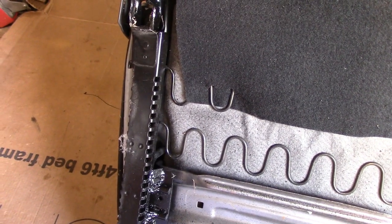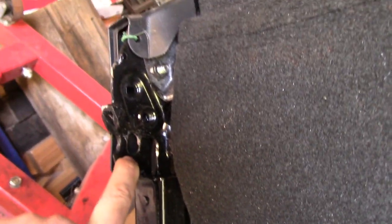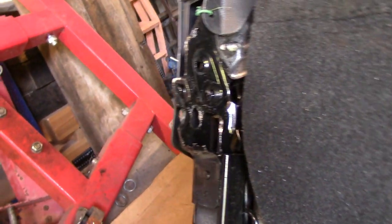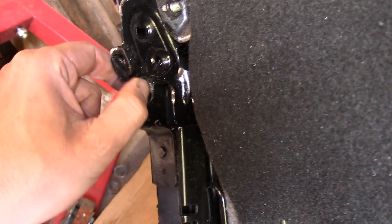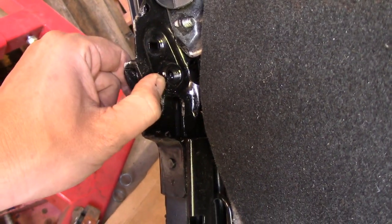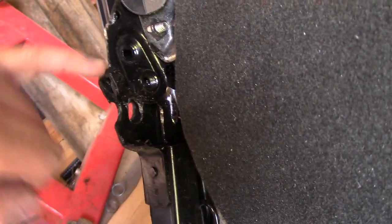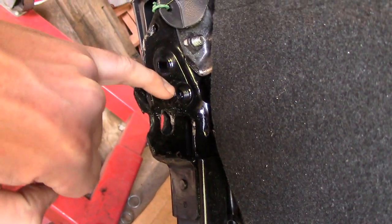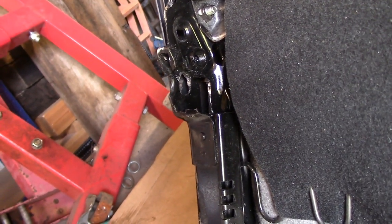The rails have a hole for the bolt from the car to pass through, with a nut on the inside. But the surrounding structure gets in the way and I can't get a spanner in to tighten it — I need to cut back about five mil around that area to access it. The other mounting had just enough clearance, but this one hasn't. I need to figure out how to do it without setting fire to the seat — a plasma cutter would be ideal but too expensive.